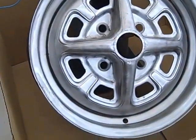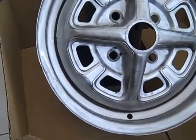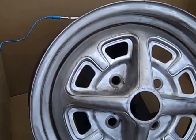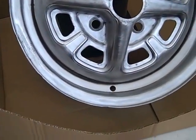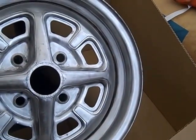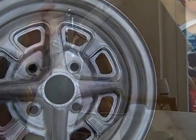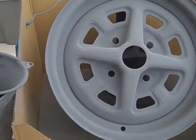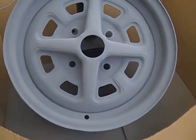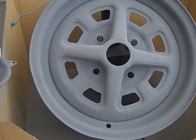The wheel has been rubbed down with a wire brush on a drill, and it's ready now for spraying. The earth lead is on, and I'm just filling up the chrome paint now, and we'll come back once it's been painted. That's the high chrome cover in a powdered version, and now we're going to stick it into the oven and see what the result is.